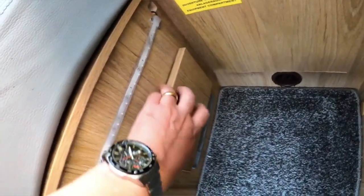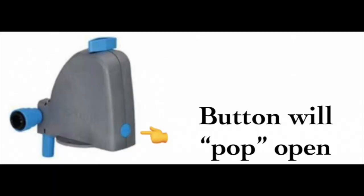Because the temperature is already quite low today when we're filming this, our frost protection valve has automatically clicked open, which is good because it proves it works. If it hasn't clicked open, you need to open it. That frost protection valve is going to dump a maximum of 10 liters that the heater and boiler system holds, to protect the system from freezing over the autumn and winter months.